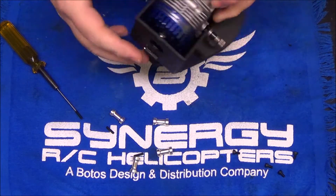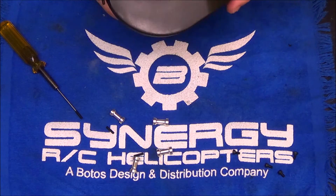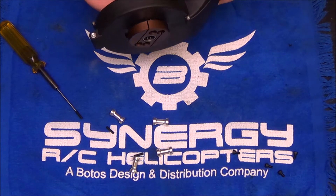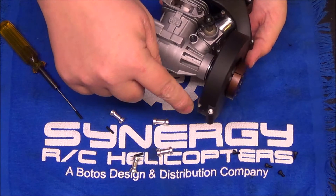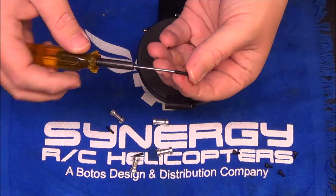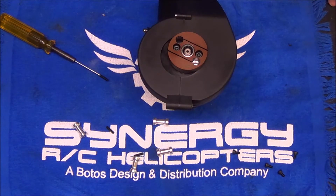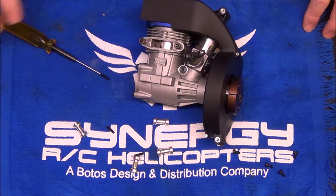Fan shroud is all trimmed and installed. It really is just a matter of taking just a little bit off the sides. My motor has a velocity stack, so a little bit of trim for that. With a Dremel and an Xacto knife it literally took me eight minutes to trim that. It's going to allow you to run any motor you want — small block, big block, GT15, gas, or whatever. The shroud is held on with a combination of four small metric screws that hold the two shroud halves together, hex-shaped pieces in the larger channels with threaded rod — Loctite that — and standoffs that go out to meet the frame. Unlike the N5C, the fan shroud and motor must be removed from the N7 in one assembly, so there's no reason you can't Loctite all these standoffs, get it all ready, set the motor aside, and once the frame is built, slide it right in. The entire fan assembly is built in 15 minutes.